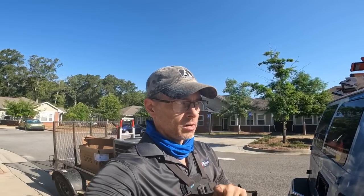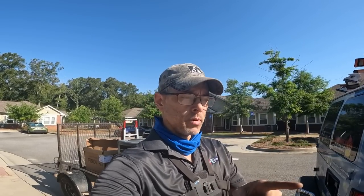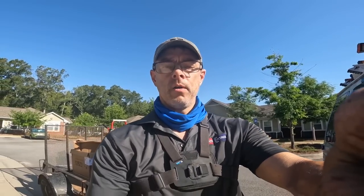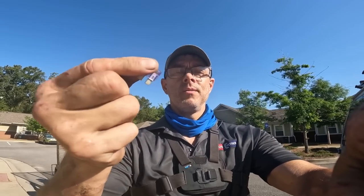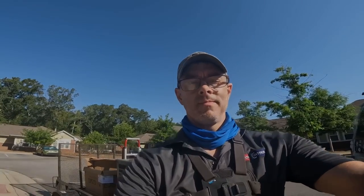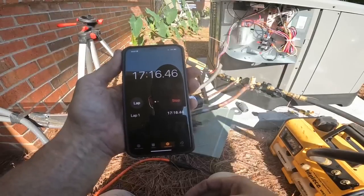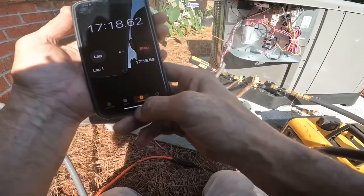Okay, in there, y'all saw me changing common from blue to brown, hooking my blues together, which we're going to use for the reversing valve, hooking up my float switch, and I have to return to put in a 3-amp fuse. Okay, up here, I'm using blue for my reversing valve and brown for common. Okay, I'm at 17 minutes